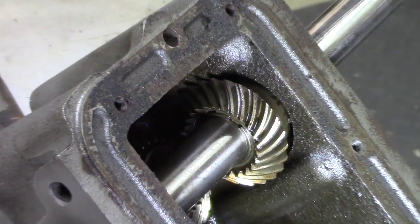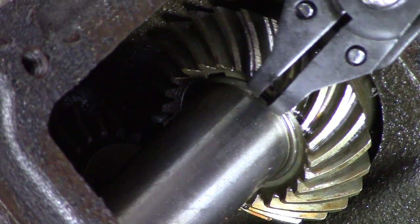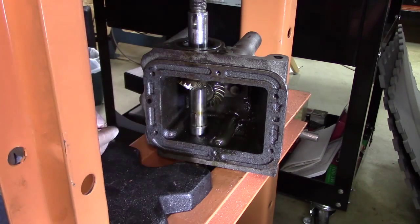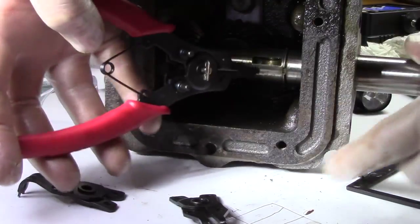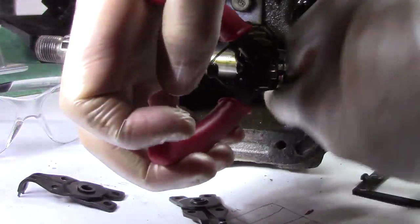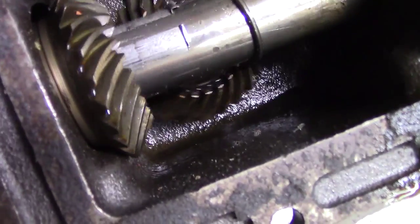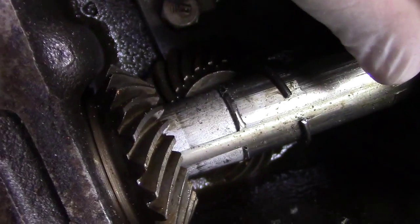This bevel gearbox has intimidated me for quite some time, but I decided to take it apart. I tried to get the clip off, but then I read the service manual and it says to just press that out to the left. So I did that. Now it's time to get that little ring off — it should just press on out. There are a couple of retaining rings that need to come out of their grooves, and then press the shaft out. The shaft started going sideways coming out and shaved a little bit of metal off, so that's something I need to scrape off and polish down.